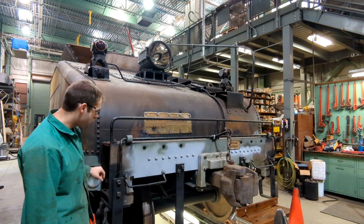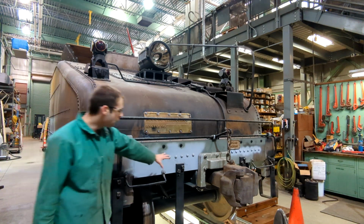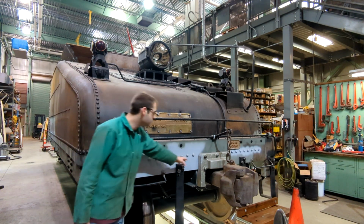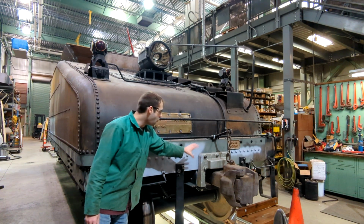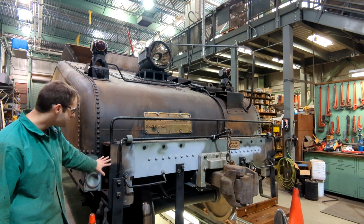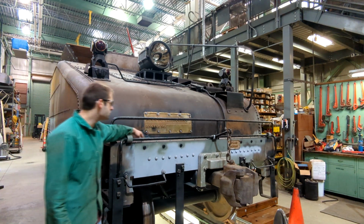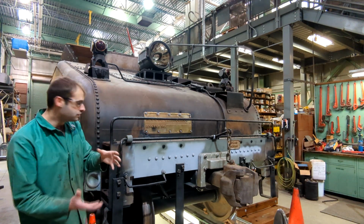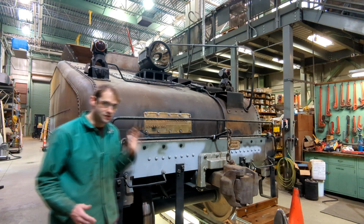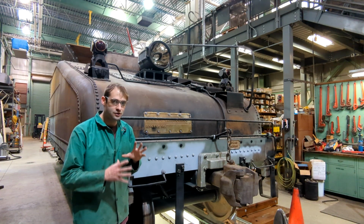And we also had to put the pilot back on, cut the boards, and get all of the structural components for the rear put back on as well, and these aren't light. So we had to make sure all of these aligned, and that was the tricky part, making sure that these step ends aligned with the holes for this and this, welding the rivets onto the top of the plate that held the angles on so the bolt holes lined up with the sides of the step. There was a lot of putting things together a couple times before we really got the look we were looking for.